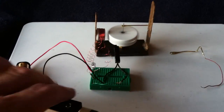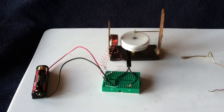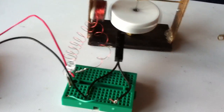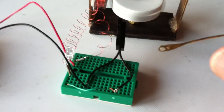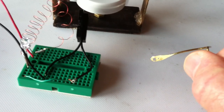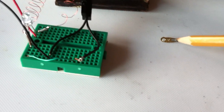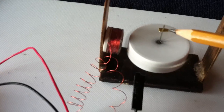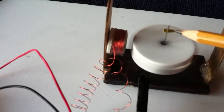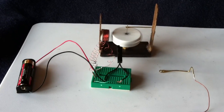I just want to share that with the guys that work on these small motors: use a little tiny jeweler's drill and drill a small hole in a flattened out piece of brass wire. I got this brass wire at a craft store — you just put it on something metallic, hit it with a hammer, and drill a little teeny hole. There's the little teeny hole right there. The needle, depending on your needle, runs in that hole. It's chrome steel on brass, which is a very, very good bearing surface. That's just what I wanted to share today. Thanks for watching.